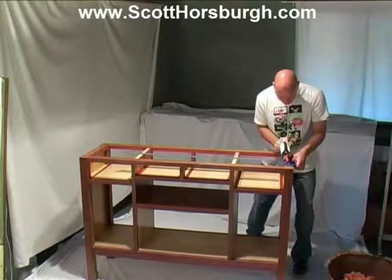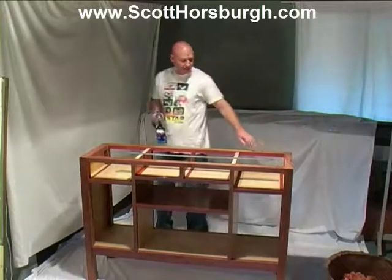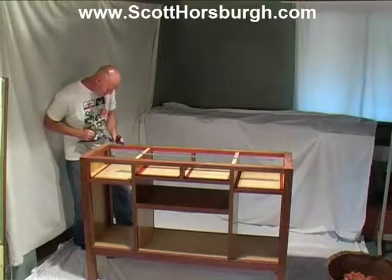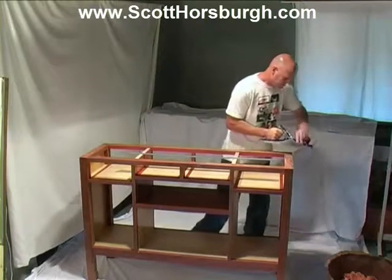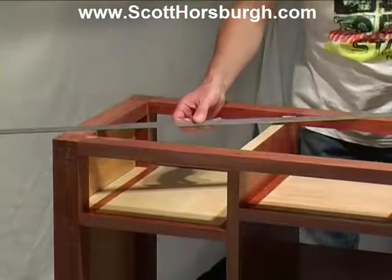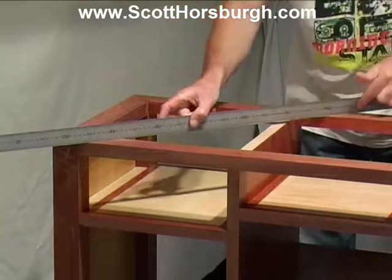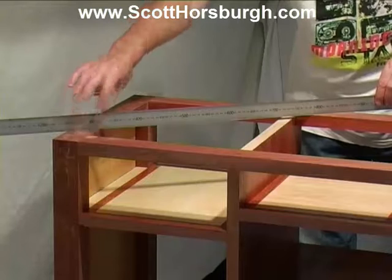Turn the corner. It's not taking much off there yet, because it's still a bit high here. So the back end of the plane is holding it off this rail. That's the beauty when you've got a perfectly flat plane. It really does make achieving what you need to achieve a lot easier. Always check as you're going along. Pop your straight edge across. And you're looking for it to be touching at the front and the back edges. And if there's a ray of light under here, that's fine.